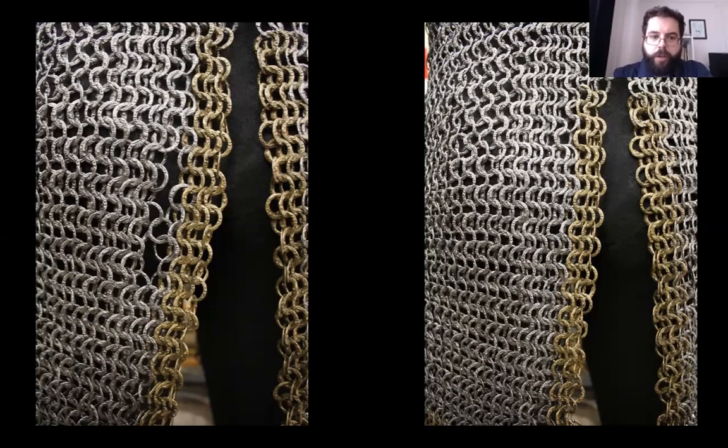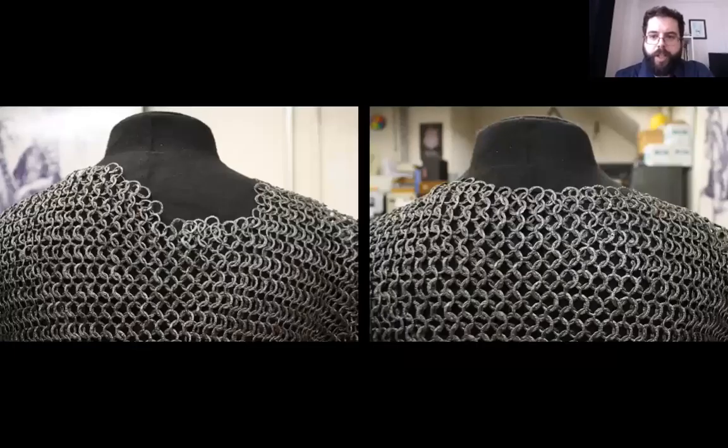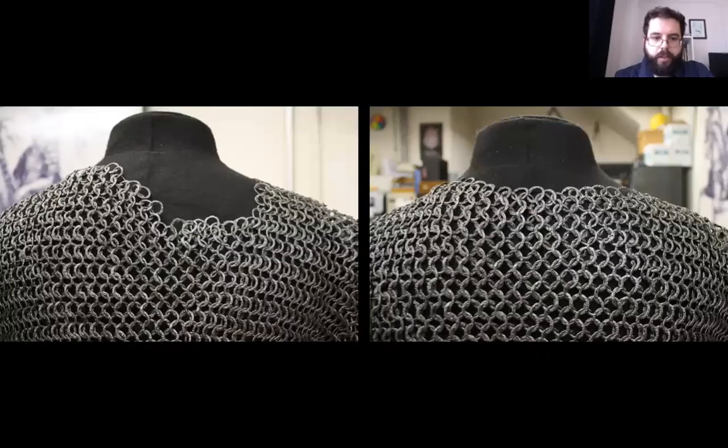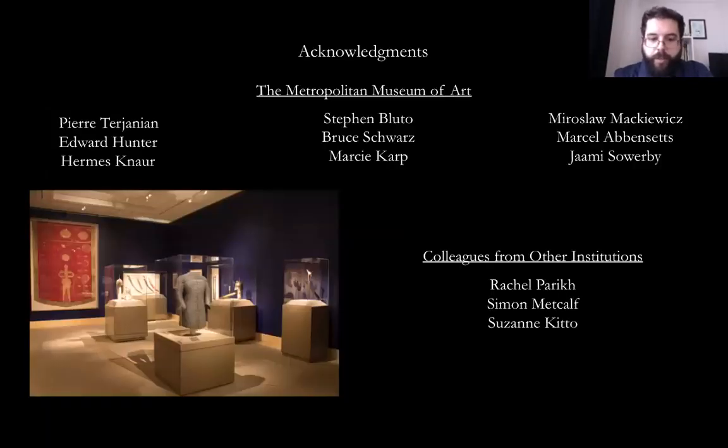Butted rings were inserted into the shirt and closed with pliers. The riveted rings were inserted around the neck and sealed using a pair of riveting pliers with concave depressions in the jaws. Here's a before and after of the neck. A total of 249 rings were inserted into the shirt. As the shirt is made up of over 12,000 rings, this means that after treatment, the shirt is still around 98% original material. The shirt is currently on display in the Arms and Armor Galleries in a small display of Islamic mail. We hope you will come see it in the museum when it reopens. Thank you for watching Insider Insights.